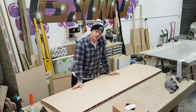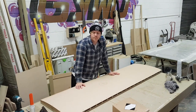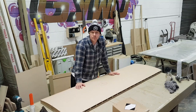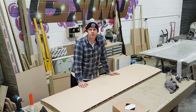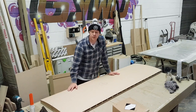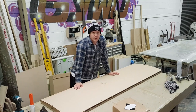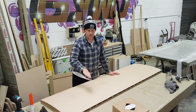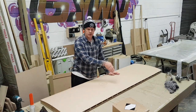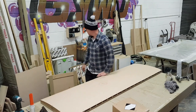And then you have to skin that with a few layers of thin MDF or ply, which I didn't realise I should have used. So I did 2 layers of 2mm MDF with a nice Hydrocure PVA in. And when I put it in the vacuum bag, it was making the laminations fall in between the ribs.